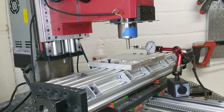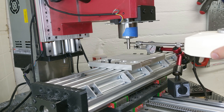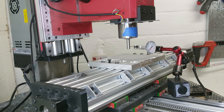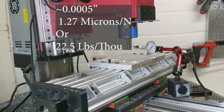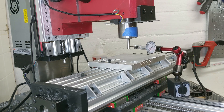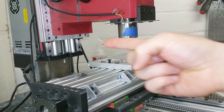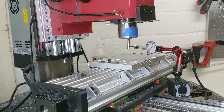I have this roughly zeroed out. It's kind of difficult to film at this angle, but I'm going to apply 50 Newtons of force and measure in the Y axis direction. That is 50 Newtons. The deflection in this axis is much lower — less than a thousandth — which is kind of to be expected. There's much less going on there; there's no left-to-right play.